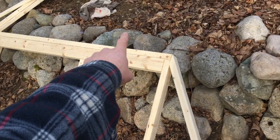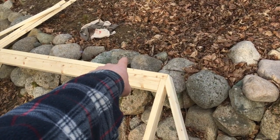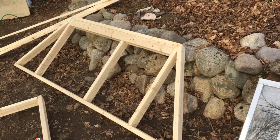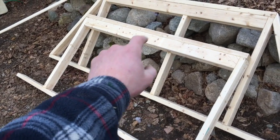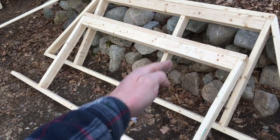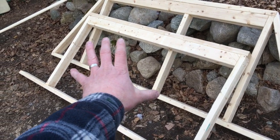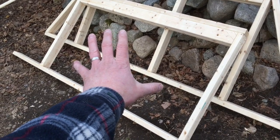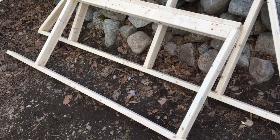There'll be some kind of additional stacks coming through the ceiling for air exchange, and maybe the entrance is through that window that acts as a door, or it'll be up above — that remains to be seen. I'm doing various versions and sketches of what will become final plans, available through relaxjacks.com. I need more of a continuous array of studs — two by fours — here because I can have a lot of earth pushing against this wall, wanting to crush and buckle it. I also need to think about drainage and sloping with some crushed stone behind this.